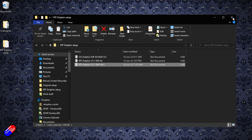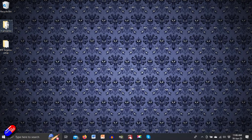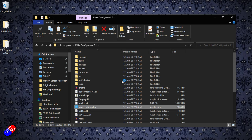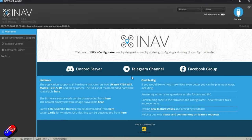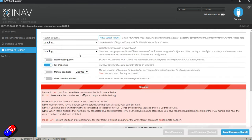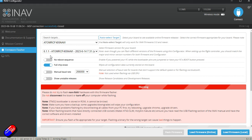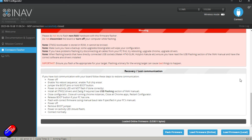To do the update, we need to run the latest version of iNav Configurator. So we'll start iNav Configurator 6.1 and click on it. Once it's running, we'll plug the flight controller back in and wait for it to boot. Rather than connect to it, we'll go into the Firmware Flasher, click 'Auto Select Target', and if it identifies the flight controller, we choose the latest firmware — 6.1.1 is the minimum I'd recommend, as 6.1 had an issue with porpoising. We'll do a full chip erase, click 'Load Firmware Online', then 'Flash Firmware', and watch it reboot into DFU mode.